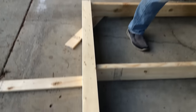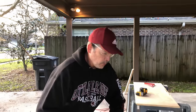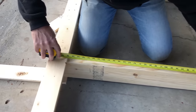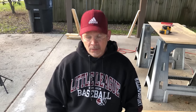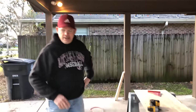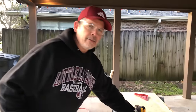One slat is attached with two screws, so we have six more to attach, meaning seven spaces. We shoved them all down and measured the distance — we're calling it 55 inches. Divide that by seven, which comes out to about 7.85, so we'll call it seven and seven-eighths. We'll cut two blocks that length as spacers so we don't have to measure anything. Any time you can take the tape measure out of it, do it.